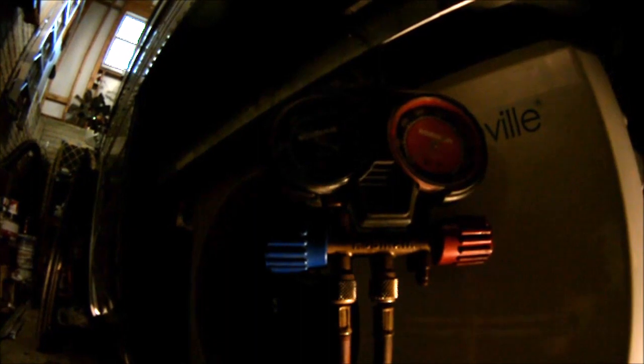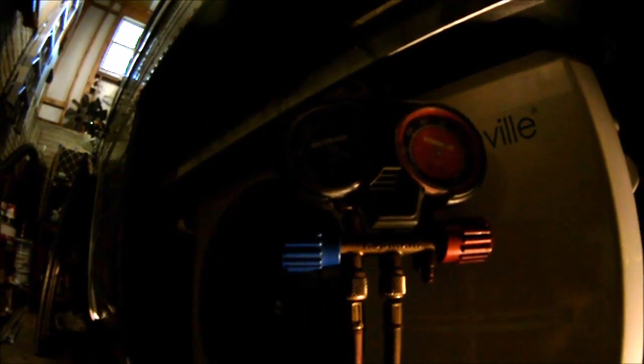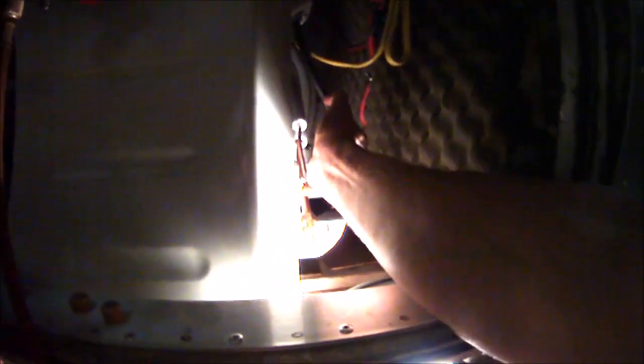So it's been about 5 minutes, maybe longer, and pressure's holding, and so we are going to take our line set off and there we go. And we are going to slowly open up our high pressure line. I don't like to do anything fast with these. Just let it bleed out on a quarter of a turn till it stops going, so that everything moves in there slowly.